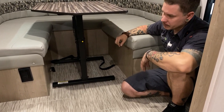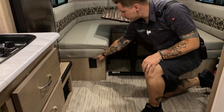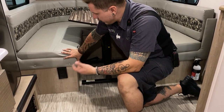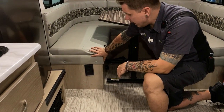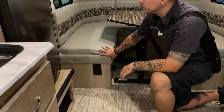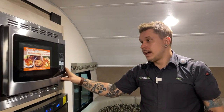Right here we have your main GFI outlet. All the receptacles in this unit are on the same circuit — they're all controlled by this reset button on the GFI outlet. If you have reliability issues with your outlets and one isn't working, chances are none of them are working. This is that reset point — functions very much like the GFI receptacle inside most household bathrooms.